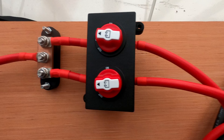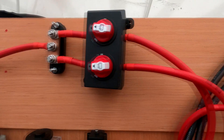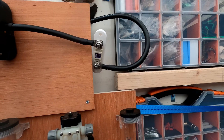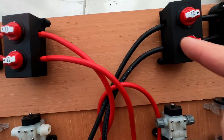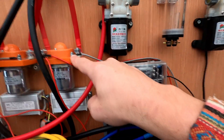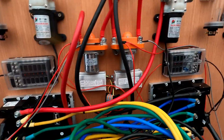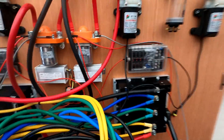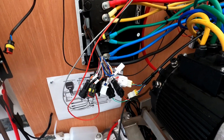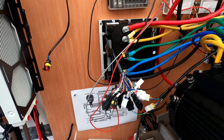That's the live that comes down to another set of isolation switches, so I can disconnect one of the motors very simply if I want to — mainly for maintenance — just by turning these off. You have the same kind of cables coming in from the negative side, and then that splits out into one going into the motor controller. The negative and the positive — the live — first goes into the DC contactor, and then from the DC contactor into the actual motor controller. I'm not going to go into the specifics of the rest of the cables because it's a little premature. I think I've connected this correctly, but I'm going to check with Golden Motors just to be absolutely sure before I share the last bit of the connection diagram.